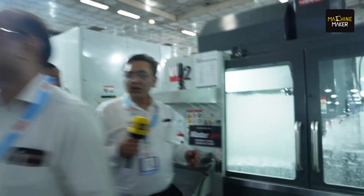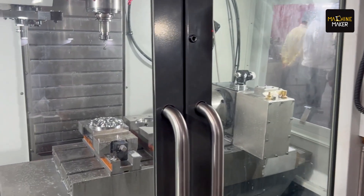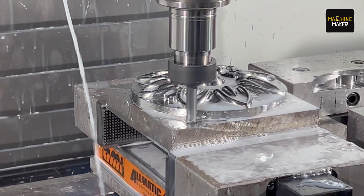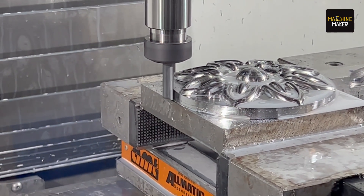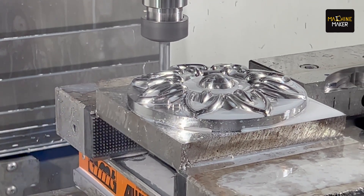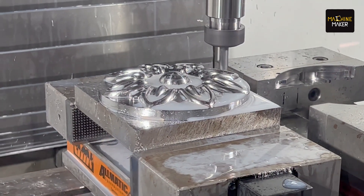The UMC is a good option where five-axis machining is required. We also have our 3-axis i-series, which is one of the largest-selling machines in the world — the VF2i. The 'i' stands for the India Value Package, which includes a lot of the latest features. Right now we are showing it for die and mold — machining an insert, demonstrating how using a fourth axis instead of the traditional three-axis approach can reduce cycle time by almost 30 percent.